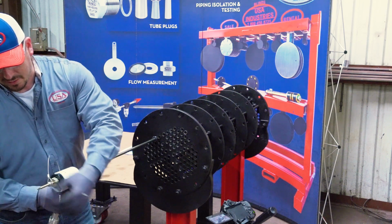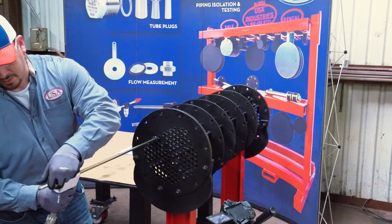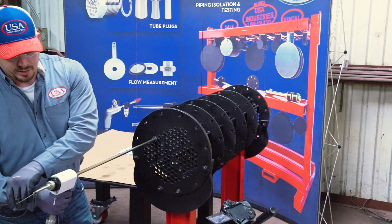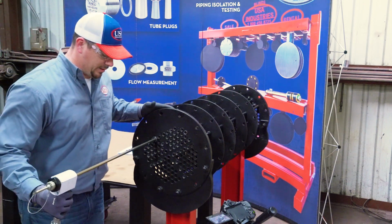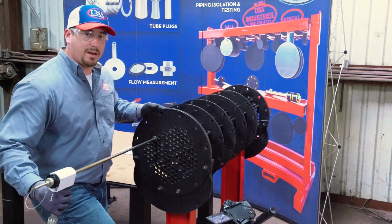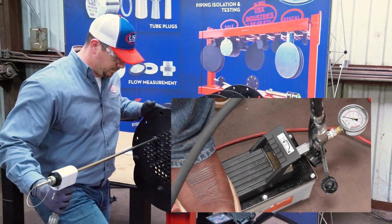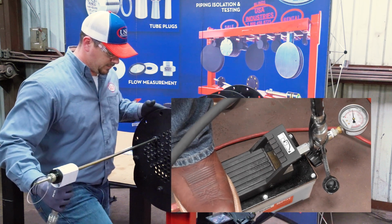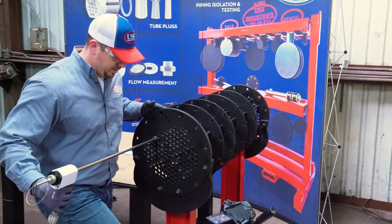After it's tightened down with the expansion nut, you want to tighten your safety cable back down to where it touches the safety cable and the expansion nut. Once again, make sure your hands are free of the safety cable and no one is around you for the second part. Now I'm going to run it back up to 3000 psi a second time. After you run up a second time, you want to decompress.